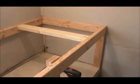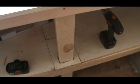This counter is already plenty wide enough - it's 36 inches across and that's including the two-by-two, so that'll be plenty big. Got the plywood cut and it's looking more like a bench now. I did run into a couple of issues - I've got to cut this off a little more on both sides because it was pretty tight and it won't work with the laminate on top. This is three-quarter inch AC plywood with the AC side on top. I was gonna get a piece of plywood to go across the front but I'm gonna have to use that up on the ceiling.